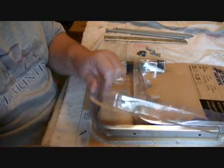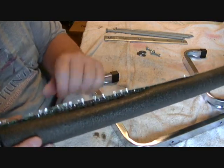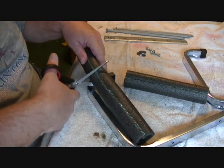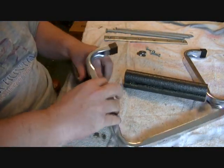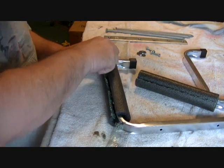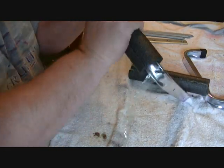The screws that come with it you're not gonna need — these are made to mount on the wall in your garage. The first thing I'm gonna do is take this foam pipe wrap. I like the kind that has the sticky stuff so you don't tear it stretching it over this. So we're gonna cut this to length with a pair of scissors. Lay that aside, stick it on here like this, then pull the plastic loose so the tape will stick. Just push those together evenly and they will stick — it will hardly ever come loose.